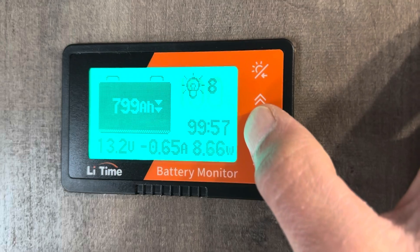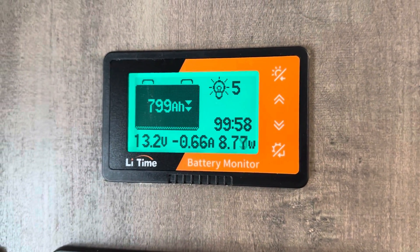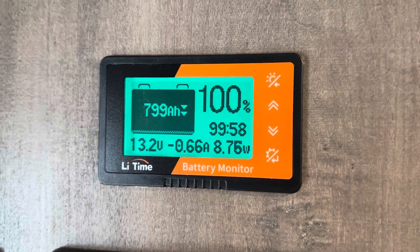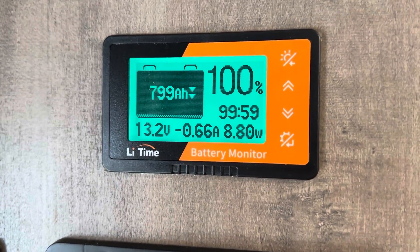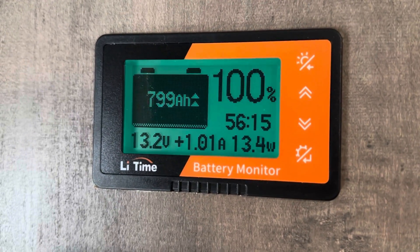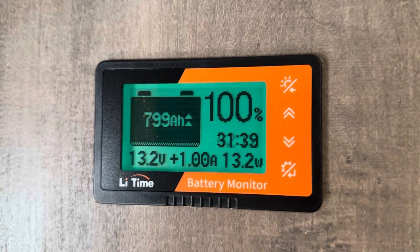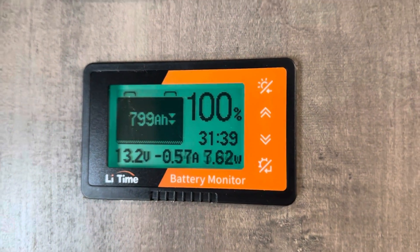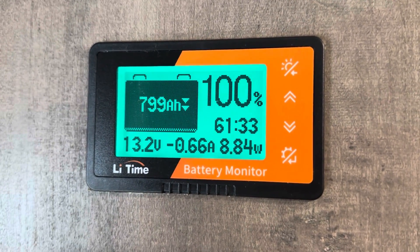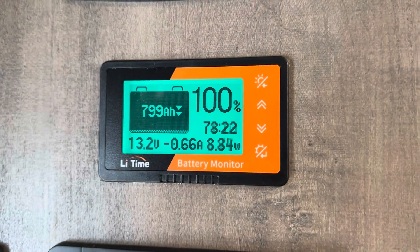Let me turn the screen down just a little bit here where we can see a little better. You can see right now I'm pulling eight watts out. I'm not making much power because it's cloudy today. So let me turn the lights off. You see it flashing, and you see this change to positive right here — that means it's charging now. Then we put a load back to it, turn the lights back on, it goes to full color green screen. That means it's withdrawing from the battery. So it comes with sensing cable and communication cable.